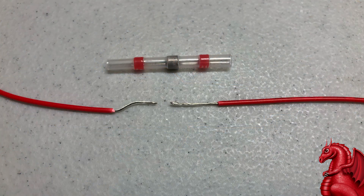The basic concept behind the solder sleeve is it's a rubber sleeve that fits over the wiring. In the center of the sleeve is a bit of solder that will melt when you apply heat, connecting the joint. The colored bands on the outer ends are a seal material that when heated will melt and create a watertight seal on your wire. Normally when you solder, you'd still need to put a shrink wrap tube to make it watertight. This cuts out a lot of steps. It takes a lot of the potential for failure out of the process — if you can use a heat gun and watch for the solder to melt, you're going to get a good joint.